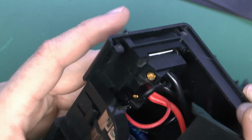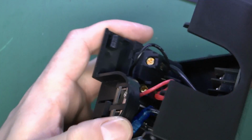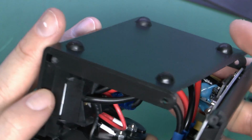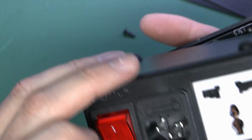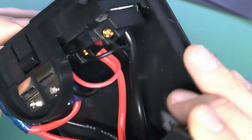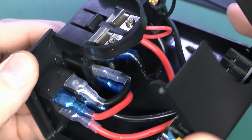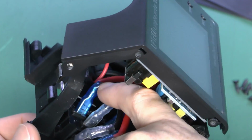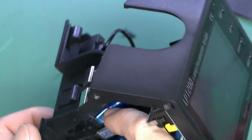And what have we got in the way of earthing on this? Probably not a lot, because they don't tend to go for that in China very much. So just see what we can see there, bearing in mind you've got your pin on the top there. Oh, it is actually connected through, surprisingly. Yeah, there is an earth connection there. It's this black one with the blue sleeving.